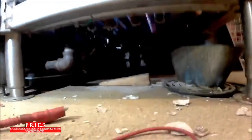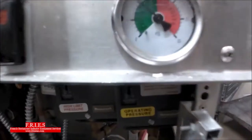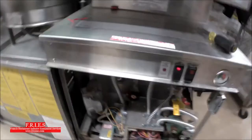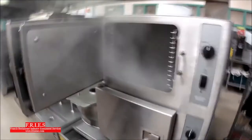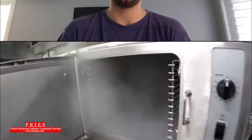We're back on and filling the boiler. We filled up, and the burner is turning on — that's good news. The last thing I'm going to test is the pressure; we cut off around 9 PSI. Let's confirm we're getting steam up into our steam cabinet. We have tons of steam. We are all good here.